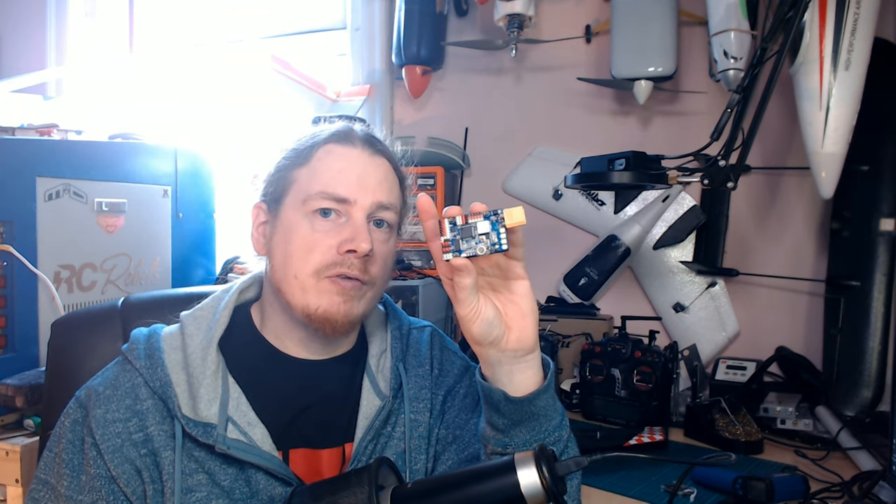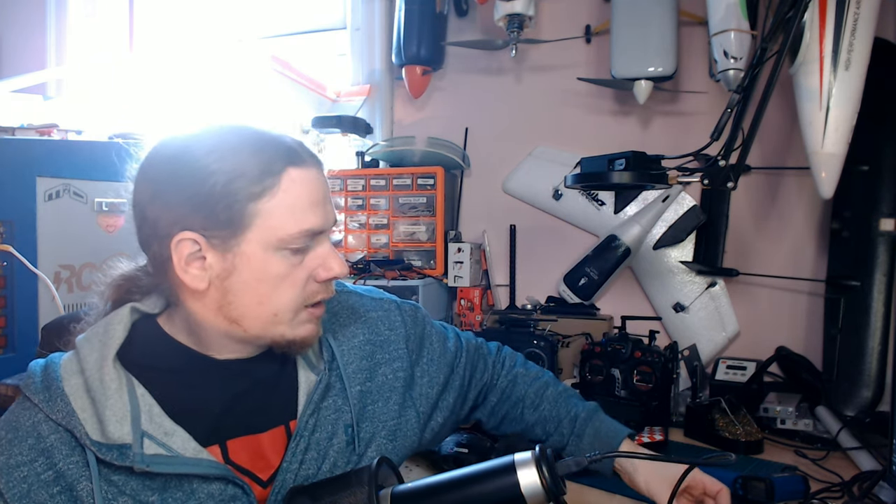I've borrowed a thermal camera so we can get the temperature. I'm going to set up five flight controllers and basically plug them in to see what happens. We have the Matec F722 Standard, the Matec F405 Standard, the F722 PX, and the H743 Slim. I've also taken my F405 Wing, which should be the same as the F405 Standard — same processor — but I'm also going to plug in the batteries so we can see if having the BECs and everything running makes a difference. They're all going to be running off USB apart from the F405 Wing, which will run off USB and battery, to simulate being on the bench.